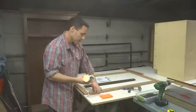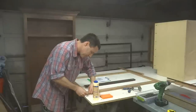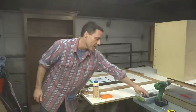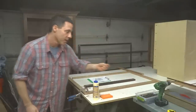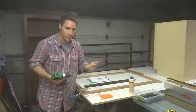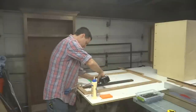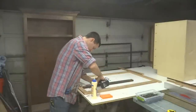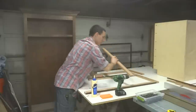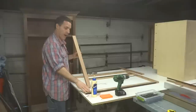So now it's just time to put a little bit of glue on and get that snugged up. I'm just going to use these face frame clamps, tighten it up, and remember I'm using the fine thread screws, not the coarse thread screws. The fine thread screws are what I need because this is cherry, which is a harder wood than plywood or pine. Remember that the face that I like best faces down because I'm working on the back of the face frames facing up.